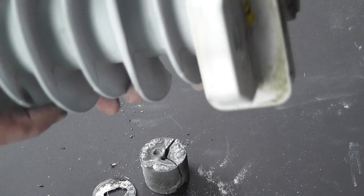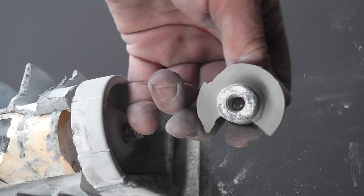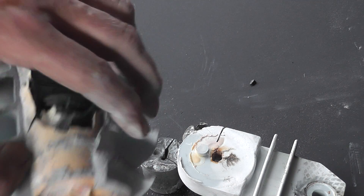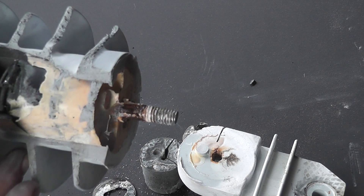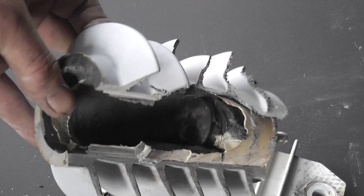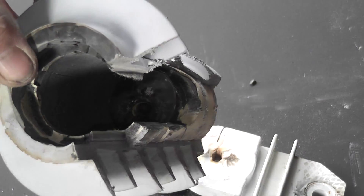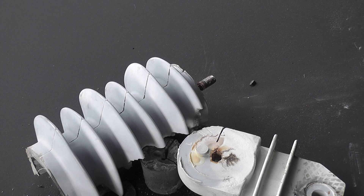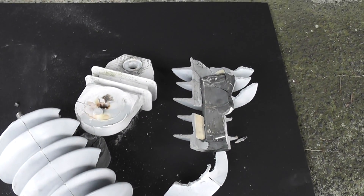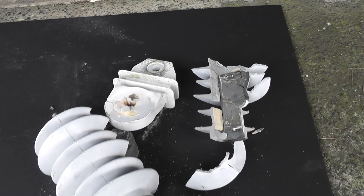Okay it vented. That's a screw-on part as well - that comes off here and you can take the stem off. There's a bit of corrosion in the end - it's a locating stud. So yeah, that's all in these things - not too much. It did probably what it was supposed to do. That's a lightning arrester - this was a 9kV rated one, clamping 7.65kV, used on an 11kV line. Overview done and it can go in the skip. Thanks for watching.